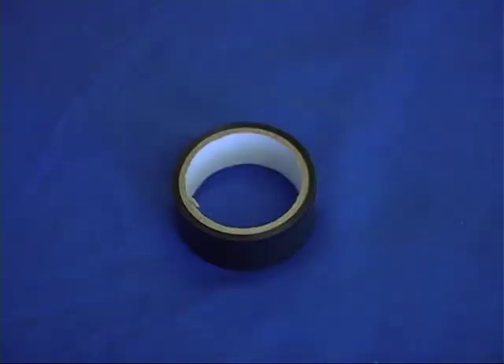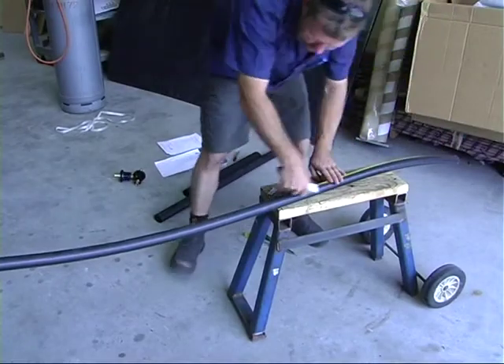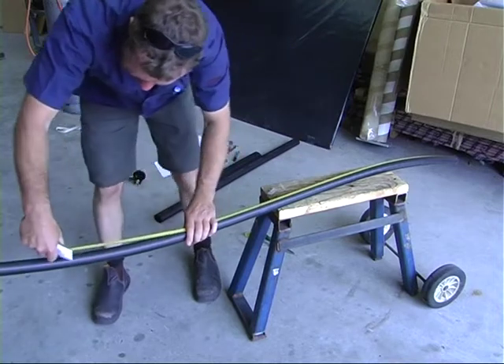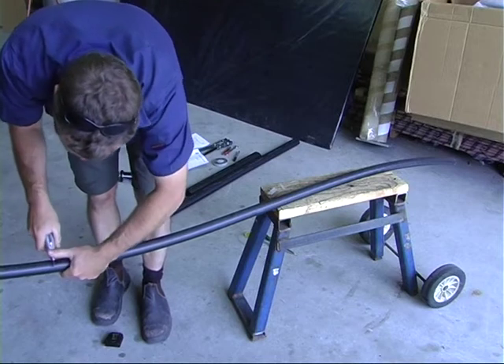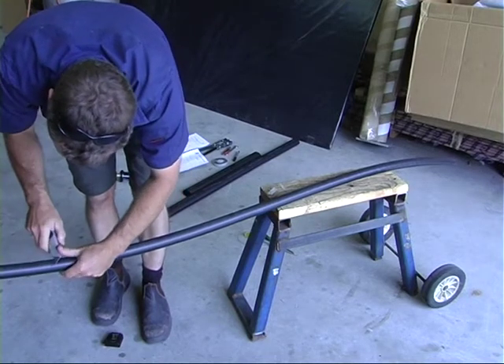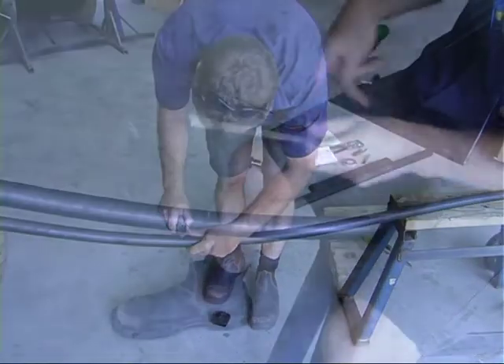The following steps outline the upper termination of the high voltage shielded cable. Remove the black PVC outer sheath for a length of 165 centimeters by cutting radially around the HVSC cable with the supplied friction tool. This is less likely to damage individual copper conductors than cutting with a knife.